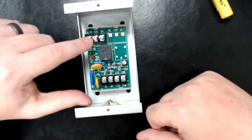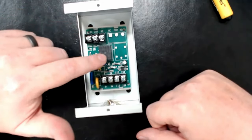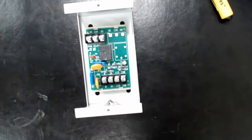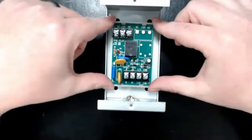On the primary side you could hook up something like a NAC circuit — something that activates any time there's an alarm in the building. When it activates, that NAC circuit powers the electromagnet and turns the switch for you. The NAC circuit is already turning on during any alarm, so now you're unlocking that door every time there's an alarm.